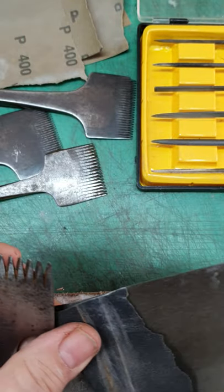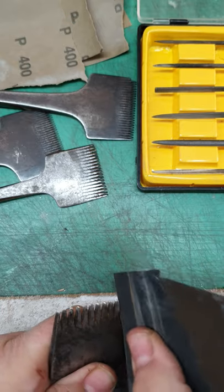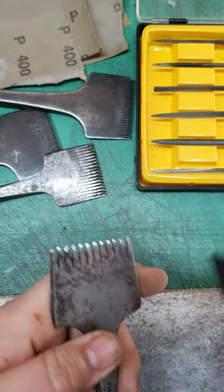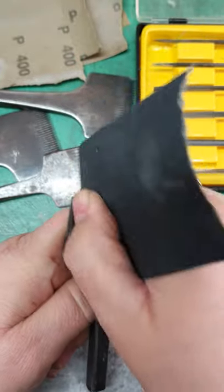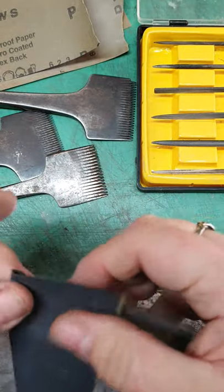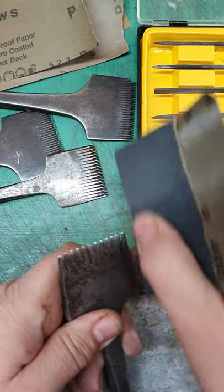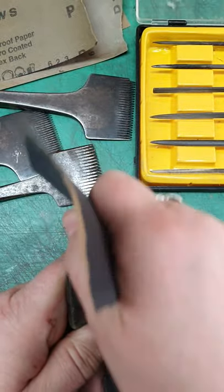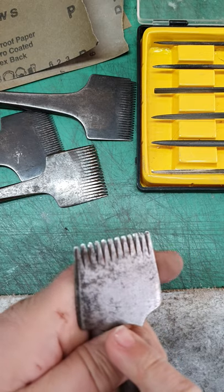Just fold the wet and dry again so you've got a fresh bit — you can see how it's wearing. I won't do this entirely because you'll be very bored watching me, so I've just gone to some 400 grit. It's quite literally just a case of doing the same process, going up through the grits. A little bit tedious but it's one of those things that pays dividends, and you'll end up with a pricking iron that's reasonably well polished and very usable. You can see how it's just starting to get a bit of a shine on it.